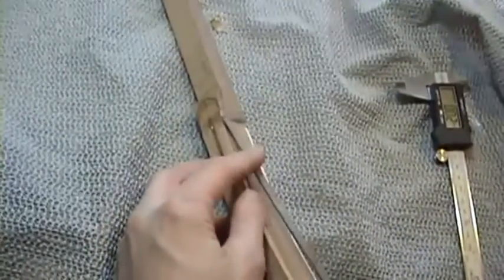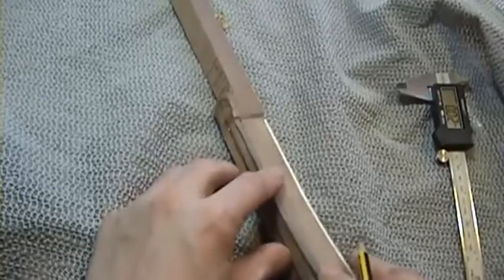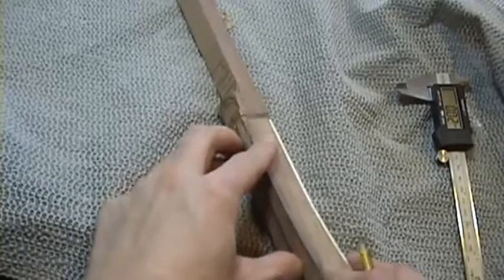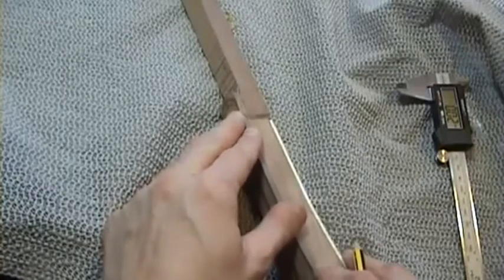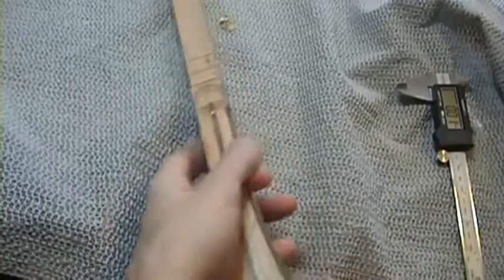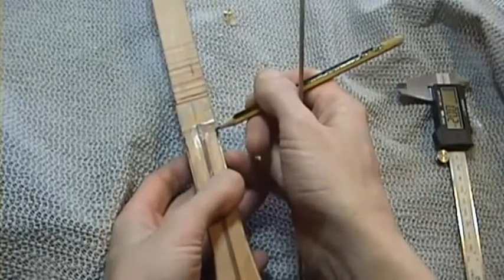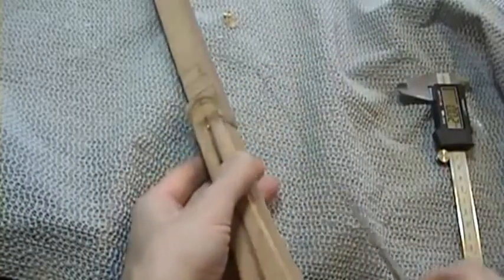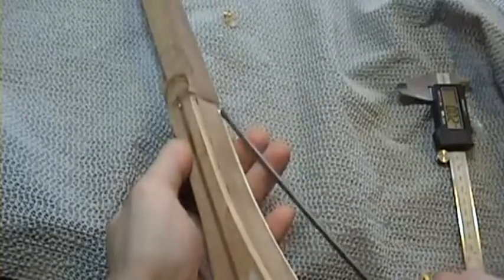Now if I just lay the lining on the groove, this slides up. I'm not doing anything fancy here. It's just going to be a butt joint over here. But as you see, the router cuts a rounded shape, so I've got to cut that in with a chisel or a knife and make sure that's nice and square. And again on the other side, and on the top as well, I've got to do the same.